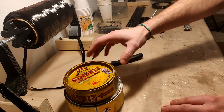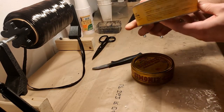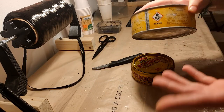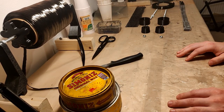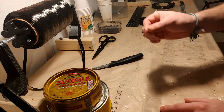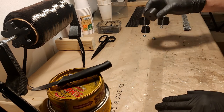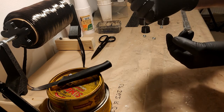For the mold release I will be using car wax today — I find it works okay. You can also use proper mold release wax. Both of these are not supposed to be used indoors, or you're supposed to wear breathing protection like the respirator I just showed you. I believe you can also use PVA, although I've never tried. For applying the wax I recommend a lint-free fabric cloth so you don't leave little hairs all over your print. You should also let the wax dry thoroughly before you start using it. I usually apply a liberal amount of wax since releasing the part is much more important than the surface finish you get with these 3D prints.